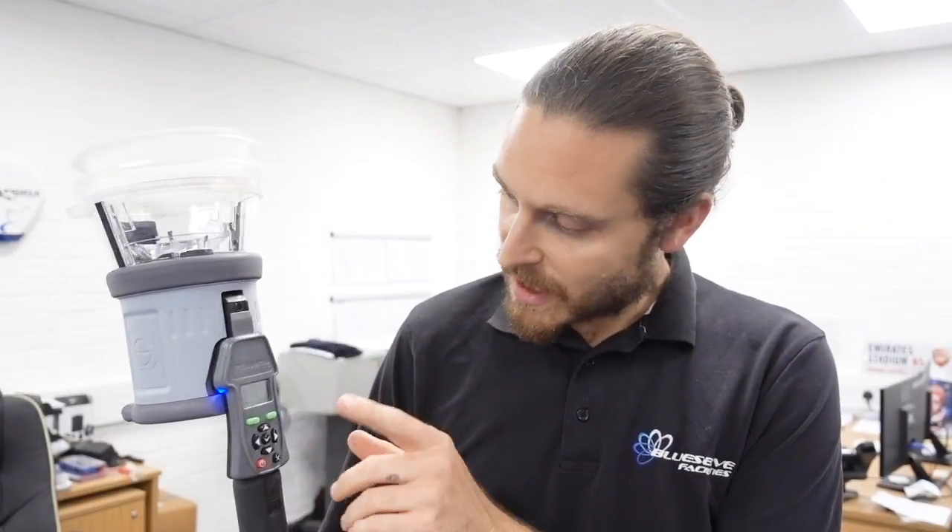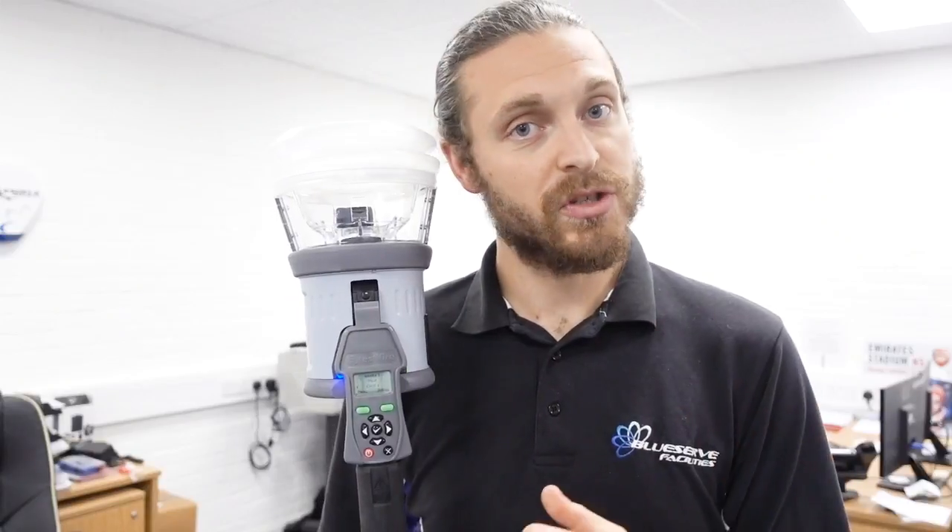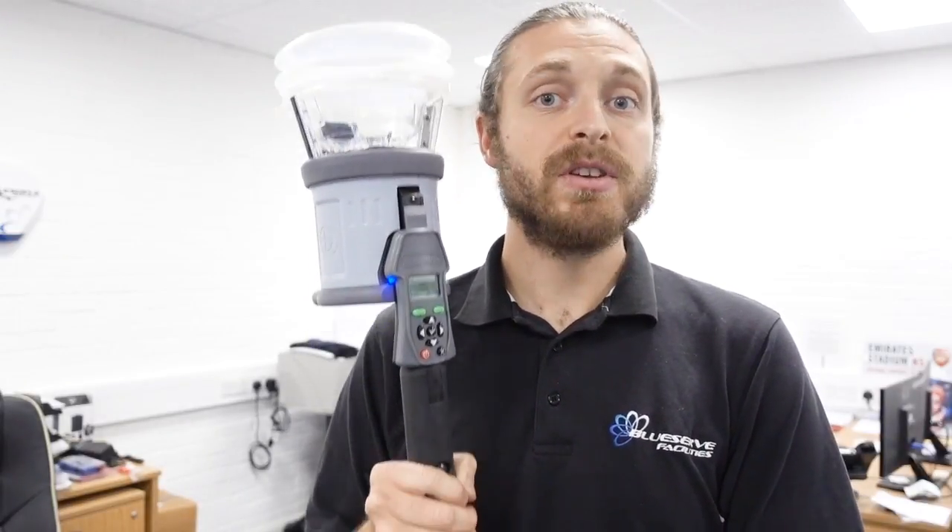So to recap - nice and easy with smoke: you select smoke, tick it, press one, then scroll down to clear, tick it, and it says clear two. You offer it up to the smoke detector, it releases the capsule, the fire alarm goes off. You drop it down and then you see the lights change color. When it does that, you offer it back up and it will start clearing the smoke out. Nice and simple.